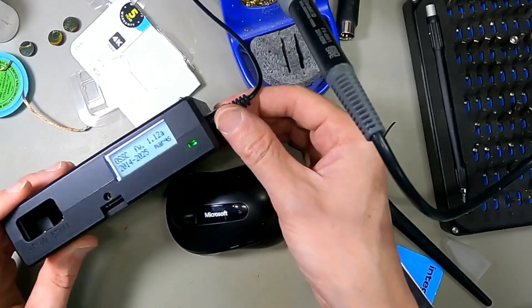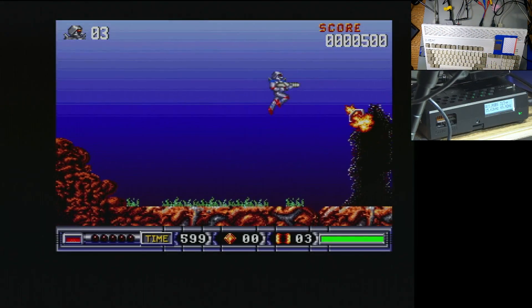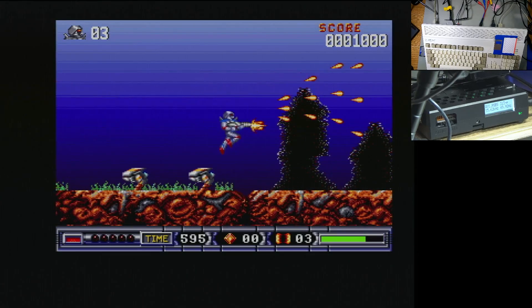All we've got to do now is just plug this in and see if it actually still works. This now should have the LumaCode option in it. Let's have a look and see if this works. And there you go — it boots up. It's got a test picture since there's nothing plugged into it at the moment. There we go — we've got our LumaCode option. So we've upgraded it to the latest firmware and we can turn LumaCode on and off. That is a success. I've upgraded my OSSC from a zero-point firmware to a one-point firmware and I didn't break anything. Still works — which is exactly what I wanted.